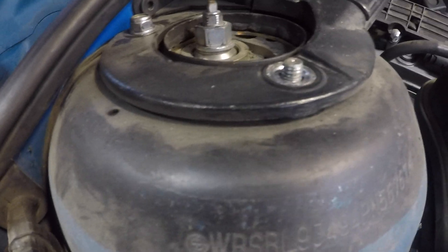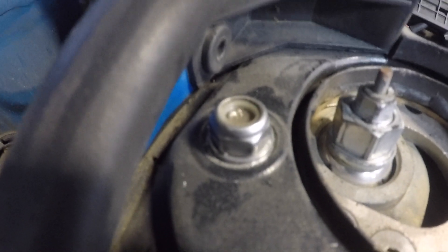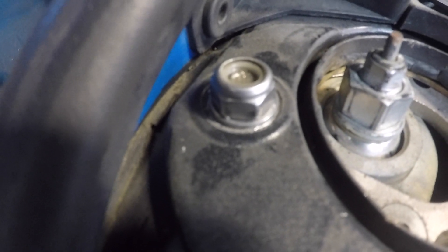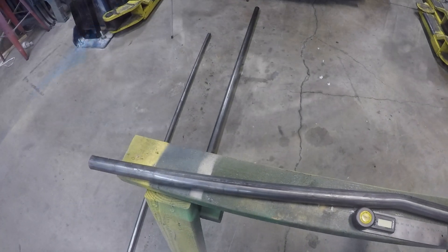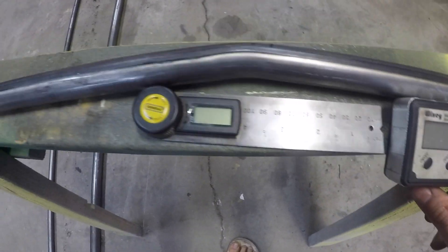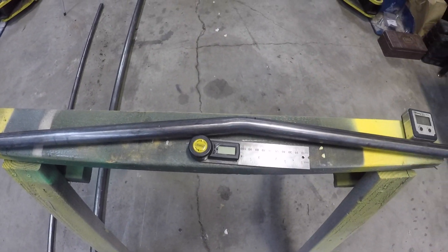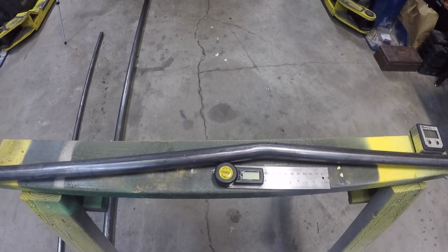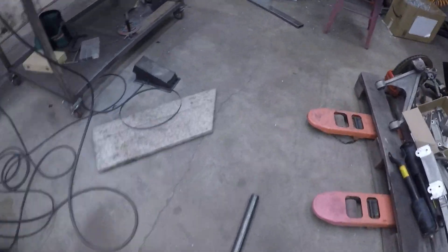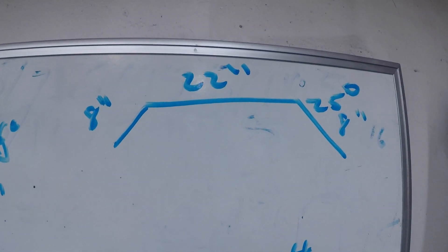So the other reason I'm doing this is the threads are too short and the plate is too thick — I think the nylock isn't really doing much of anything. Using my state-of-the-art digital angle finder along with this angle finder, I made my first bend. Still need to make another bend.